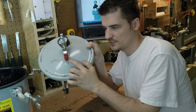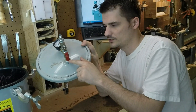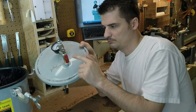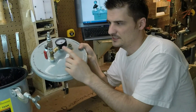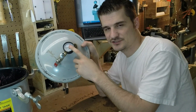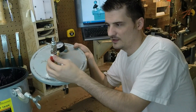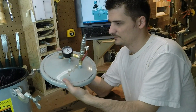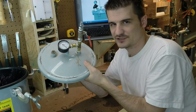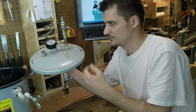Really all you've got to do is use the other hole, and I believe that's a quarter inch pipe. I've got a tee in there — teed off to a gauge. This is the gauge that actually came with the pressure pot, so I didn't have to buy a new one. I've got a ball valve and an inlet line. You remove all the stuff that came with it and install your own.